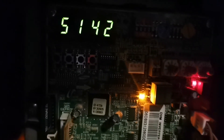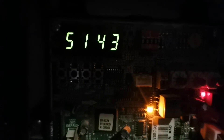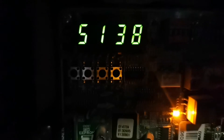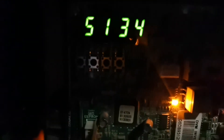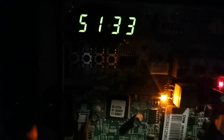We're basically watching the unit run and making sure it starts up properly. The suction pressure is a little high at 14.2 bars right now. Five flashing means we are on option five. Everything seems cool. I'm going to let it run and finish putting everything back together. At that stage I will reset the unit and they will have to switch on the units manually at the wire controller at their wall stats.